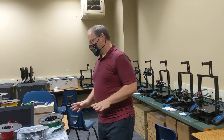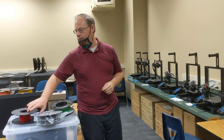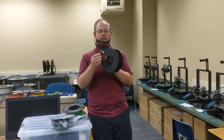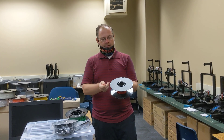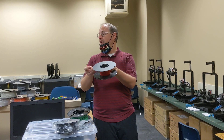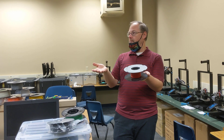Here are a bunch of filaments — there are different types and they have these little holes in them. The reason for that is to keep the spool from getting tangled. If the spool gets tangled, when the filament is being pulled it won't be able to pull anymore and your print is going to fail. So when you take your filament out, make sure you put the filament into these little holes to keep it from tangling.